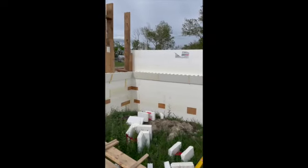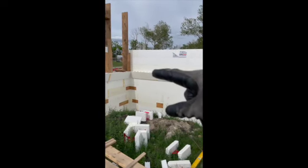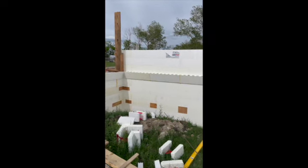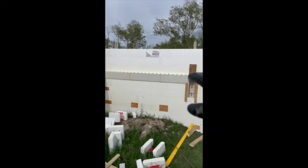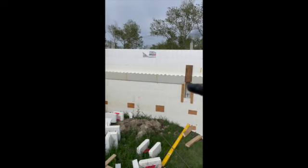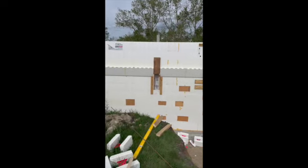And the top of my I-beam needs to be flush with the top of my ledger board, so my decking can run flush over the ledger and the I-beam. And so I'll show you how I'm building out pockets to support the I-beam, to give it a ledge 8 inches below this surface, because my I-beams are 8 inches. I'll show you how I did that.